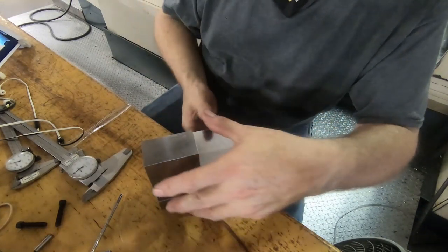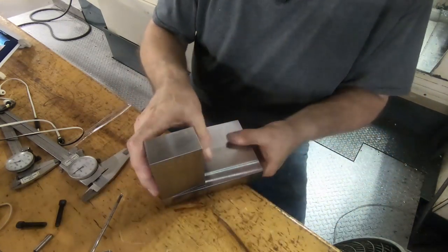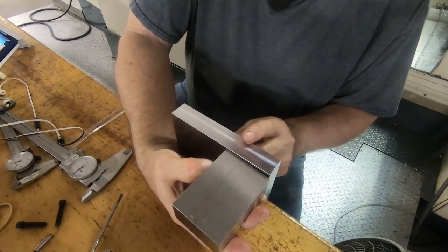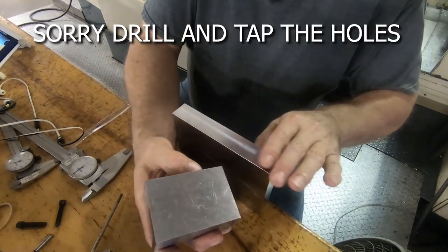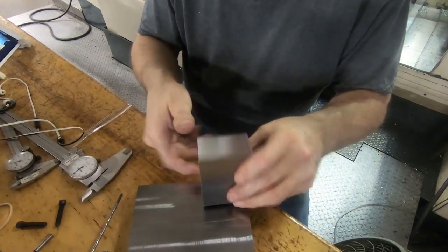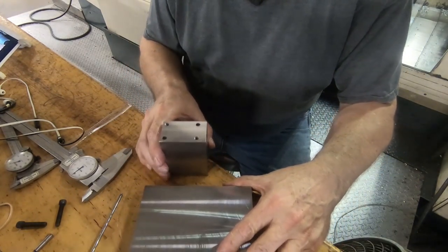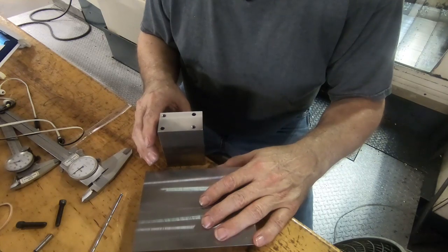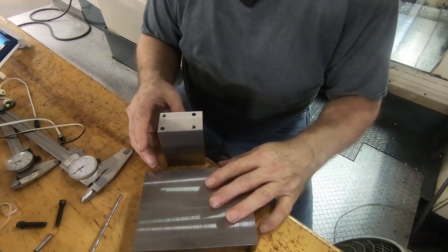Only at that time, because we still want this long side to hold it when we hold it this way, if you will, and tip it at the angle in the B axis to mill this taper on this piece. So we want the full width of the part up to that point. So you've got to think of these things when you're progressing in a job and how you're going to not get one thing ahead of itself. It's not that you can't do it, but it becomes more difficult if you don't give it a little forethought.